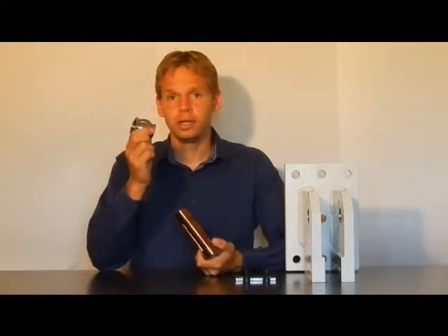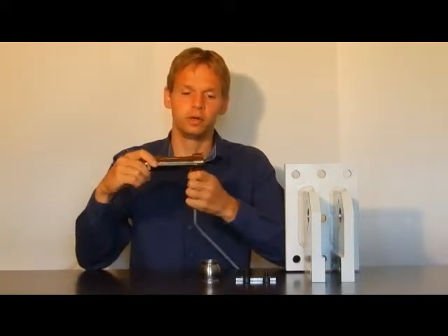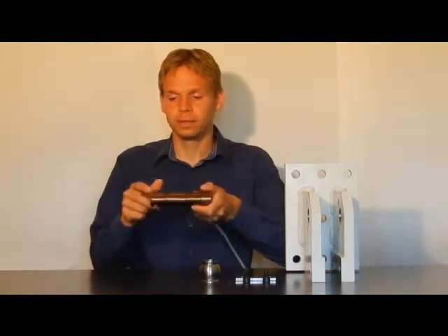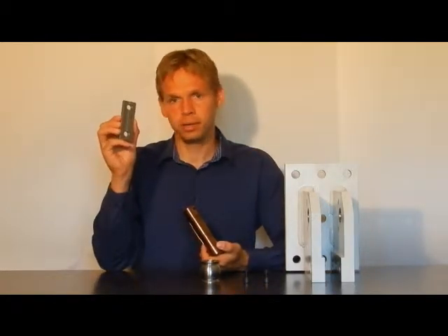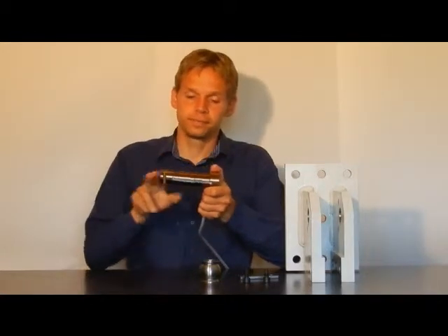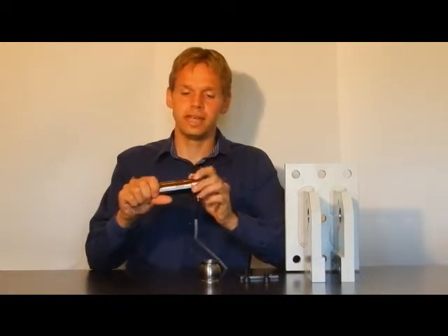We also have a ball here for CAT3 agricultural functions. The load pin has a head with electronics inside, and the rest is a sensor. Here we have anti-rotating keys. This anti-rotating key matches with an anti-rotating plate which is mounted in the application. The load pin has three parts: here comes the force from the top, and here the reaction forces on the left and right hand side. Also the head with electronics.